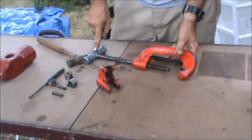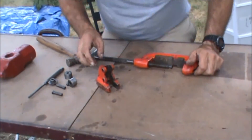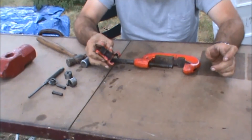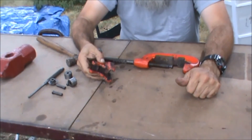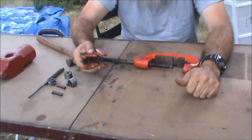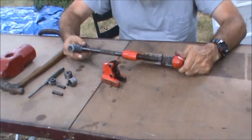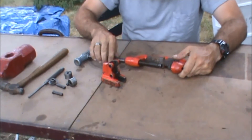To complete the disassembly, you would back the screw out — I'm not going to do that here, there's no reason to do that. That would be a good time to clean all this stuff off, and a good time to tape off all this stuff and repaint it. I would rough all that up with steel wool. You could unsoak all this — you need some kerosene or diesel fuel. Both of those are pretty flammable, so don't smoke around it. Be careful. Go ahead and clean all that up, get a brush and clean all this up. You may want to polish this slide right here.